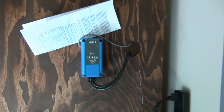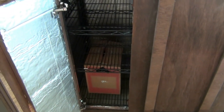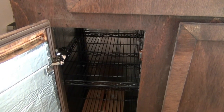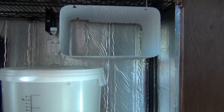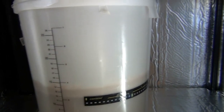I'll show some clips of that in the building section if you're more interested. On the front side, our shelving was designed so we could put whole cases down below, or very large bottles like champagne size. The middle tier is designed to hold primarily 12-ounce bottles, and the upper tier is designed to easily hold 22-ounce bottles. The upper chamber has a very large refrigeration unit — it handled an eight and a half cubic foot refrigerator previously. We can actually get the fermenter and several carboys in here.